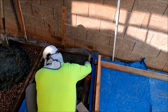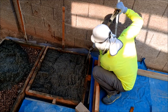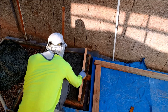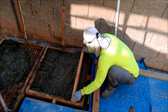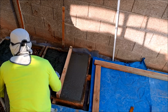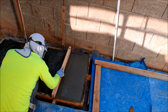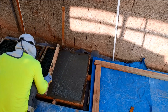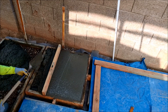Not only is concrete mixing physically intensive, but getting the appropriate mixture and the correct amount of water is essential to making a strong paver. Screeding the concrete is essential for a level and smooth finish. Make sure the timber you use is resting on the frame and the frame is clear of any debris so you can slide the lumber back and forth — it's the vibration motion that allows the concrete to settle and the aggregate to drop to the bottom.